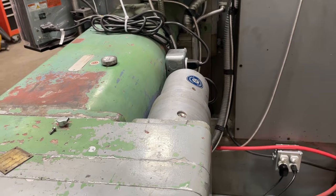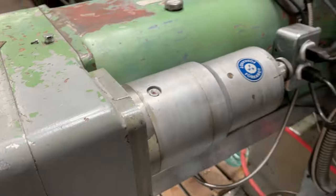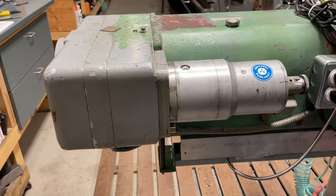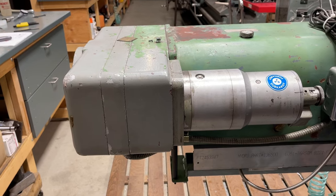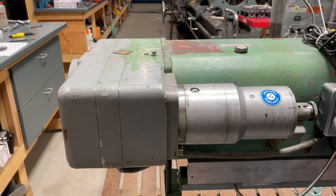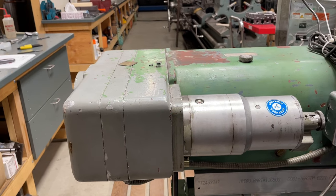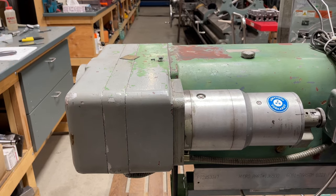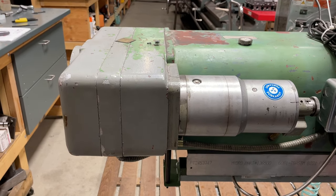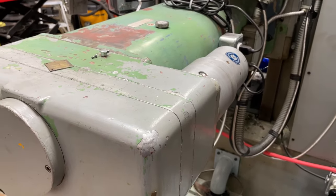And they are not very deep, and they're ramped. And then there's a spring, which is controlled by this knob here, a spring that forces them together. So when you engage the motor to clamp the tool in, the dogs are engaged and it spins the drawbar. As soon as the tool seats in the taper, the drawbar suddenly becomes very hard to turn. Eventually the torque output of the motor goes up, and there's enough torque on the dog clutch that the ramps create enough force to overcome the spring load holding them together, and the dog disengages, turns 180 degrees, and as it's going by the next slot, it slightly engages before it gets ejected again, and it creates a hammering effect. And that's the hammering you heard when I was installing and ejecting the tool there.